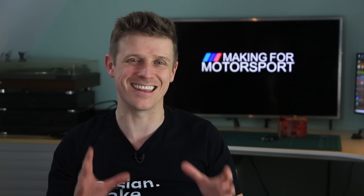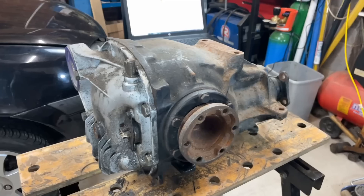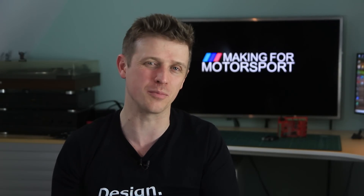We're going to scan a differential from an E30 BMW, and for me this is pretty much the perfect use case for 3D scanning of mechanical items. You've got bolt centers, various flanges all on different planes, and there may or may not be symmetry — you can't quite be sure. This could be measured up by hand, but because you've got everything on different planes and often don't have straight lines of sight between bolt holes, it's actually quite tricky and time-consuming.